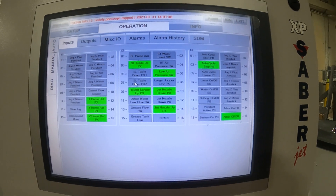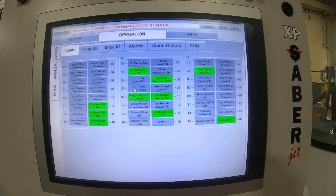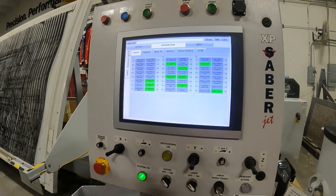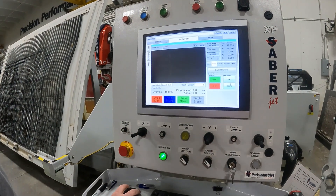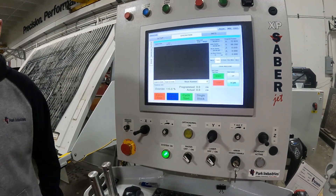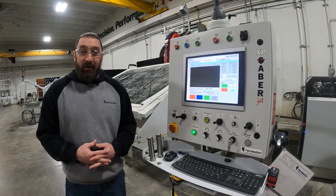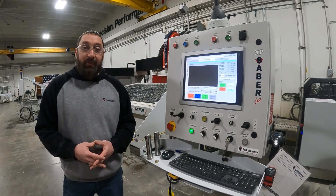I'm going to make sure I pull my pins out. You do not want to come down onto those pins with the table. Pull them out, and then the hydraulic pump should start up, and we can come down with our table. So now that we have that coming down, it should be good. As always, if you do have questions along the way, give our customer service department a call and we'll help you out with that. Thank you.